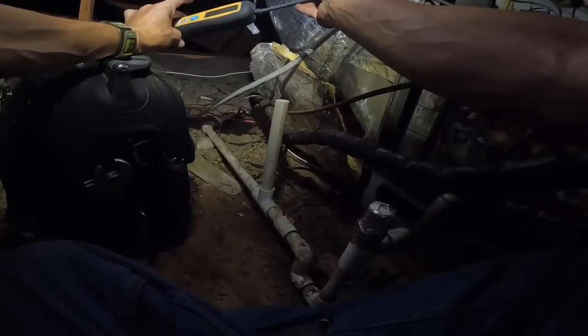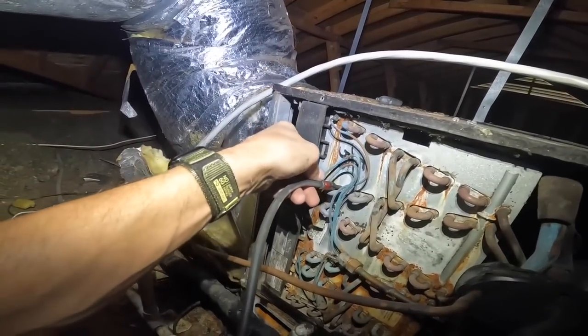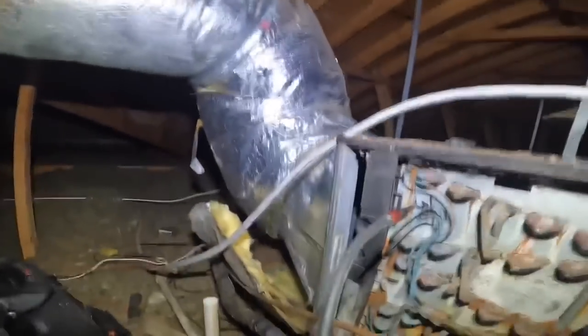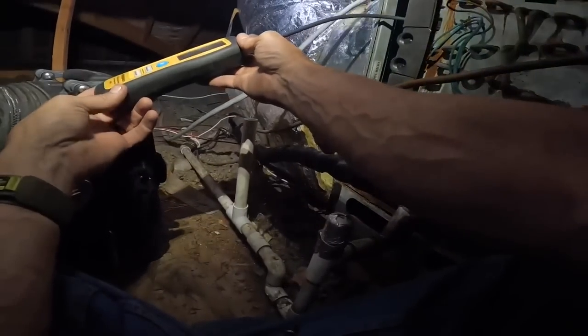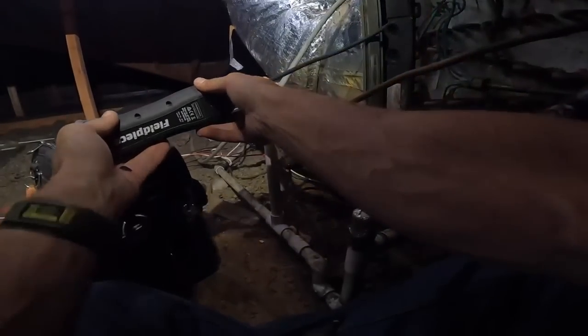Up to a 5 right there. You know, I guess right about to look at it, kind of negate some of this danger stepping through between these 16-inch things here. Mm-hmm. Now, I'm going to tell you, code is, if we install a new one, we're going to have to lay down a walkway. Oh, okay. And that was probably code when this one was put in, but somebody didn't do it. Yeah, I see what you're saying. I would think the house was built in 92, but I would think that 30 years ago they should have had a walkway. I'm pretty sure this is the second air conditioner that's been up here. Okay. I'm thinking somewhere in there it should have fallen under code. Because there's a panel for an old one right there.